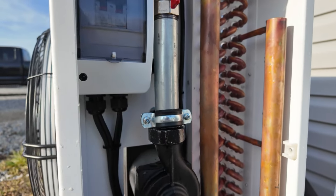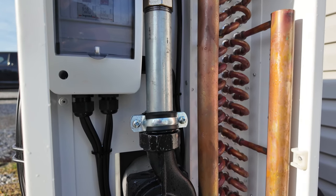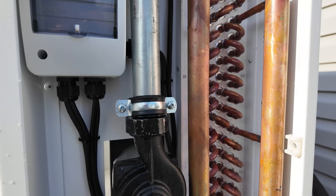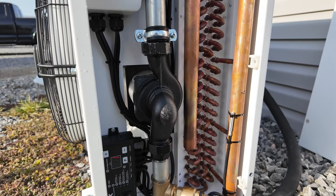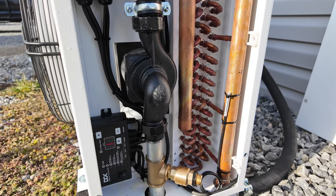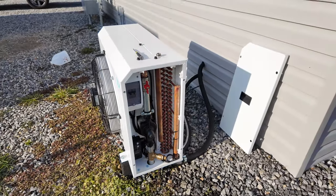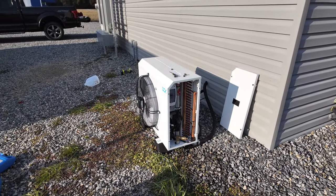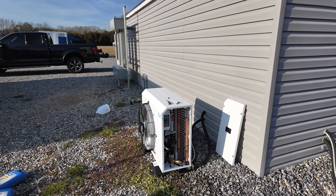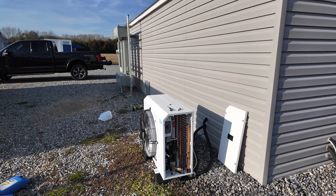You know, this is about the leak point, and you'll see that it's wet there, but I believe that's just residual. I don't think it's actively leaking. I was hoping and thinking that this is not going to be such a big leak that it's going to make the system unusable, and it doesn't leak instantly. Only when I get towards like 0.8 bars of pressure. So my thought process is it'll basically leak until it can handle whatever pressure, and if that pressure is good enough, then so be it.